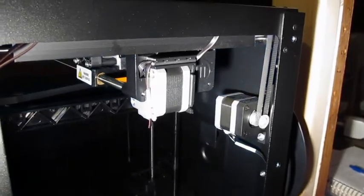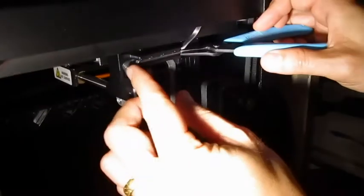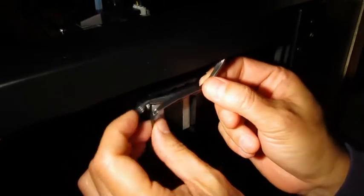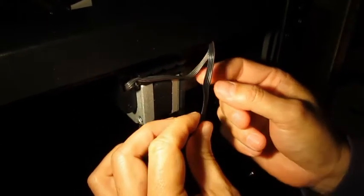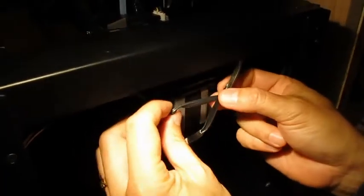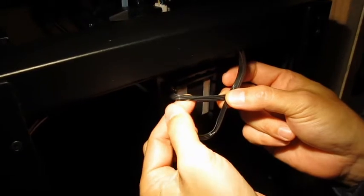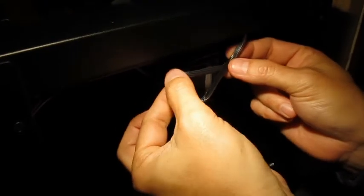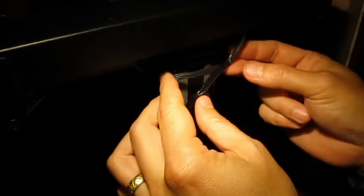So we're going to go ahead and replace it. I'm going to turn off the power now, and this is a little cotter pin that's very easy to remove. Then we can see how this wire is routed. I think right here is where it's damaged, because when I do this it starts working again. But now that I have it out, it's looking pretty bad over here as well — it's really just where it's creased, and this is really tight especially when this is all the way back in the Y axis.